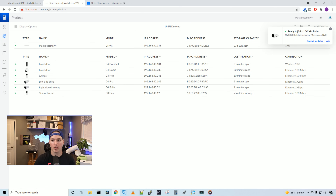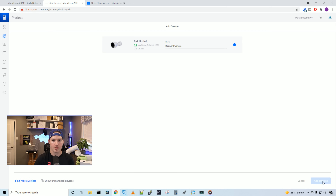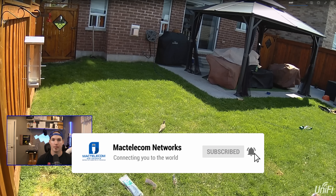I'll power cycle the port just to make sure the camera gets an IP out of my MacTelecom Camera VLAN, then press confirm. We can see that port 5 is up and active. Let's go over to my NVR — we can see in the top right corner that we are ready to add the UVC G4 Bullet. I'll press Add and call this 'Backyard Camera,' then press Add Device. The camera is added into the controller but it's updating — this will take a minute. The camera is now done updating and we can see it's at Ethernet of one gigabit per second. Here's the view we're getting right now — I'm going to switch the angle up a little bit after this video, but I'm pretty happy. We can see pretty much my whole backyard. I still need to add Ethernet surge protectors to the ends of the cable — these are very important. If it gets hit by lightning, we don't want it to blow all of our other equipment. If you have any questions, please leave them in the comments. If you liked this video, hit the thumbs up, subscribe, and hit the bell icon.